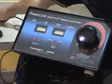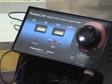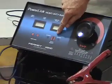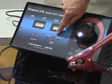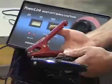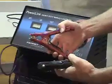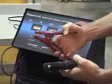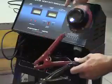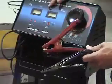The next leads, which are the large leads, are the ones connected directly to the battery. Through the volt select position on the piece of test equipment, we can select external battery voltage or internal battery voltage. These are used for checking the internal battery voltage and get clamped directly onto the battery connections, positive and negative. The leads connected here are in series with the amp meter on the inside of this piece of test equipment.